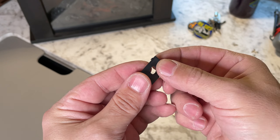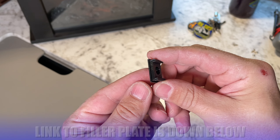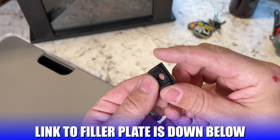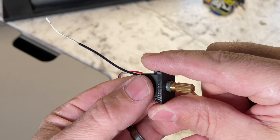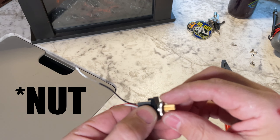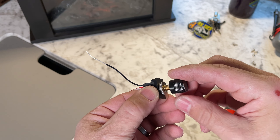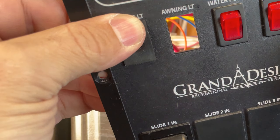This is the base we are using — it was custom 3D printed a few years ago and will snap right into the panel. I will put information down in the video description on where you can get these, or you can make them yourself with some ABS plastic sheet. This plate fits in panels that are about one-eighth of an inch thick, and the switch opening needs to be three-quarters of an inch by a half inch. Once you have the switch disassembled, you'll just slide the post through the plate, install the washer, and eventually reinsert the dial — but that is going to be the absolutely last step of this process. For now you can just snap the plate into the panel.